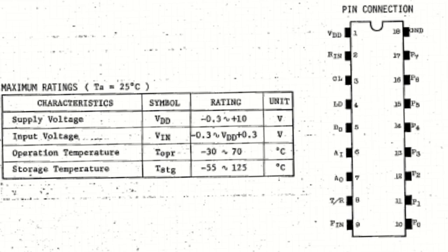A PLL chip takes these encodes and outputs a signal to control a variable oscillator called a voltage controlled oscillator or VCO. The PLL also takes a signal from the reference oscillator. In a typical AM/CB radio, the reference oscillator runs at 10.240 MHz. The PLL uses this as a reference to measure feedback from the VCO to perform calculations to ensure it is on the correct frequency.